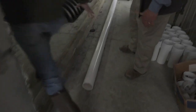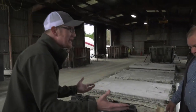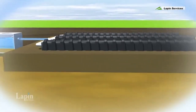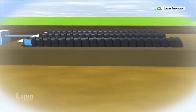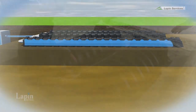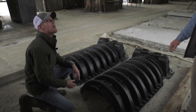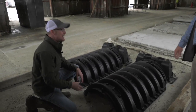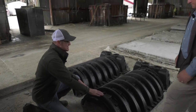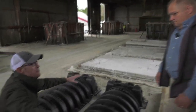So that water's going from here, traveling down a piece of PVC pipe like this, and then going out into this thing. Rocky, you mentioned earlier a drainage field. What does that mean? All right, so the drain field is where the wastewater is actually disposed of. Underground. Okay. And what you have here today is one brand, Infiltrator Quick 4, and this is just one of the products you can put in the ground for wastewater disposal. Good, and we have to put this pretty deep because you don't want somebody driving over top of it, flattening this, getting that wastewater everywhere, right?